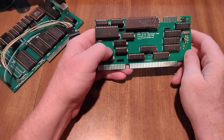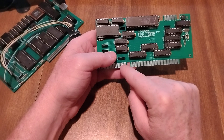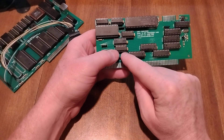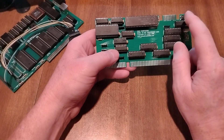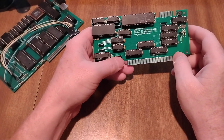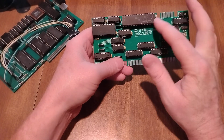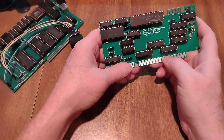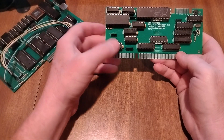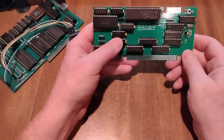I've got an LS125, and this is just for enabling some things — mainly used for the IO MEM16 chip select coming off the 16-bit bus to tell the bus controller. I also ran the ALE signal for the ISA through here so that it goes to the hold of the DMA controller, causing the ALE to float. When the processor goes into a hold state, all of the address and data needs to go into a float/tri-state status, so it can go whichever way the DMA controller pulls it. The ALE was the one signal that wasn't being floated like that.